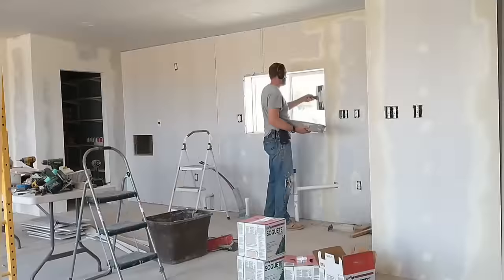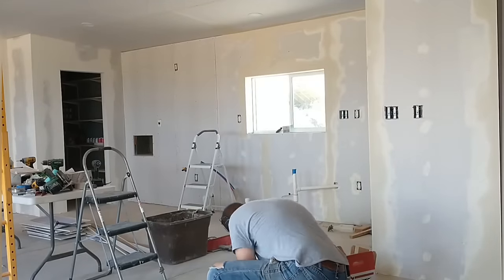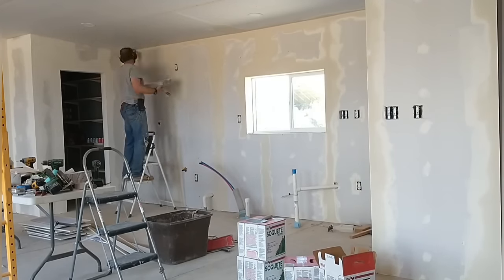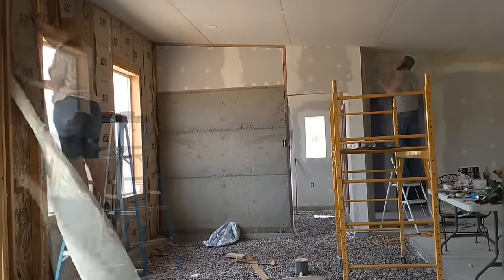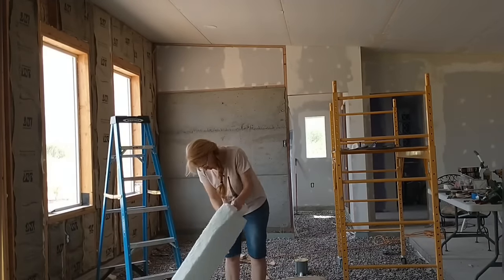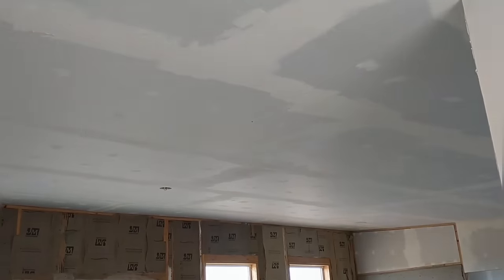Just about finished up in here and moving on to mudding in the kitchen area, starting on the wall and then moving on to the ceiling. I use the pre-mixed mud because it's so smooth — you don't get the lumps that cause streaks when you drag it across with your trowel. To me it's worth buying the pre-mixed stuff. Meanwhile April is finishing up the insulation on the southern wall — that's the last she has to insulate for this room. We're almost done with this main living area.